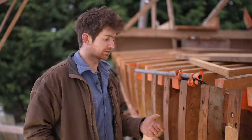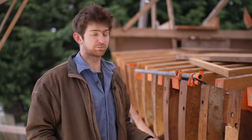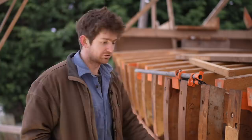With this, though, I wanted to do it in the same way that it was done before, but also I actually think that hollowing out the back of the planks, especially when you've got a lot of planks and they're narrower, is actually a lot less work. It doesn't take that long to do it. We have a pretty good system, but when you're flattening the frames, you have to make sure the angle where two flats meet is exactly where the plank joins, and that has to line up the whole way along the boat on every seam, and to me that sounds like a lot of work.